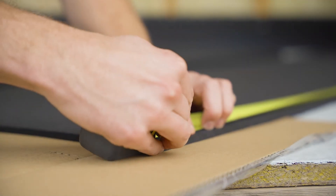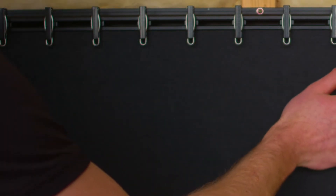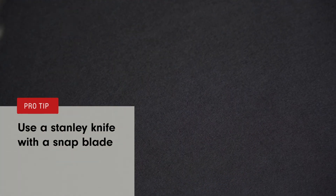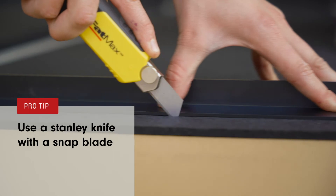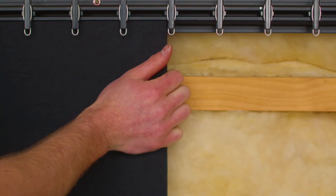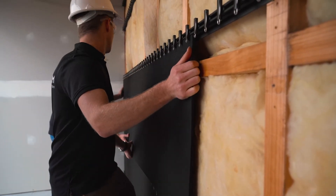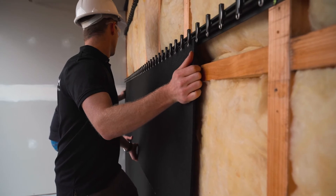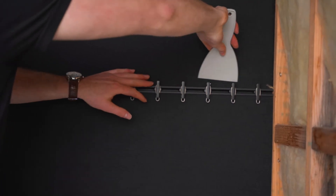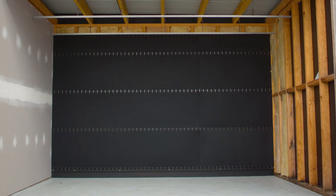Step five is to install the acoustic backing. Before you install it, make sure you cut each piece to length. Your acoustic backing fits in between the tracks. Pro tip: when cutting the acoustic backing, we recommend a sharp Stanley knife with a snap blade so you can achieve a straight edge every time. Make sure your cut is in line with a clip so that the edge will be hidden by one of the battens. Fit the acoustic backing by first inserting the bottom edge into the specifically designed groove in the track, then bend it slightly to fit into the grooves in the track above. If you need to use a tool to help guide the backing into place, ensure you don't mark the visible face of the backing.